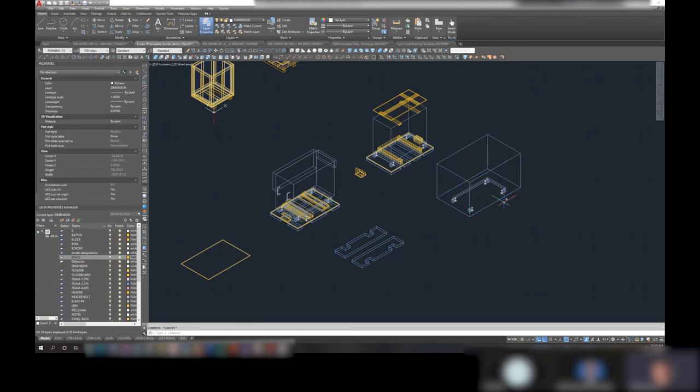Then the only thing we can do is either enlarge the floater, make it bigger, or change the foam density. No more 2 pounds. Maybe we use 4 pounds, or increase to 6 pounds in order to cater for the weight. So normally I would make the floater almost the same length and width as my machine body. You get me? Don't try to save some plywood cost. Then you got problem, you make yourself difficult. Better to make it even a bit bigger than the machine, never mind. It's okay. So this is the theory.